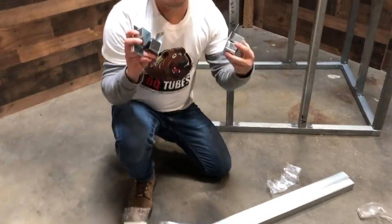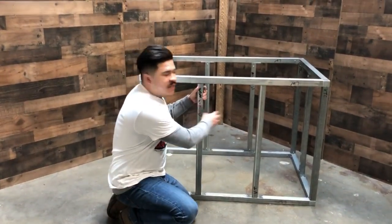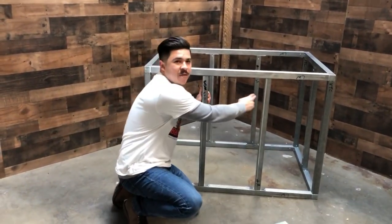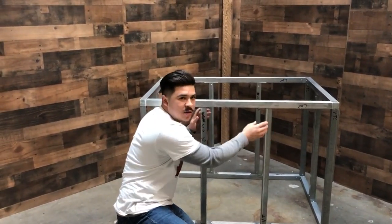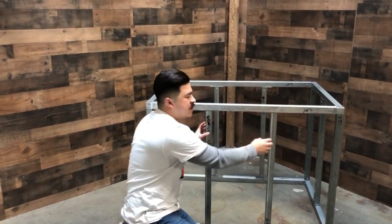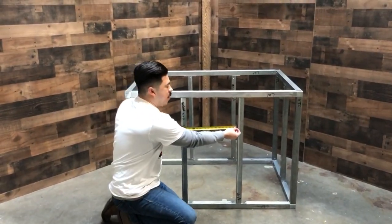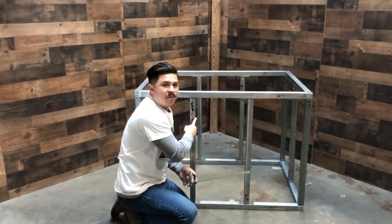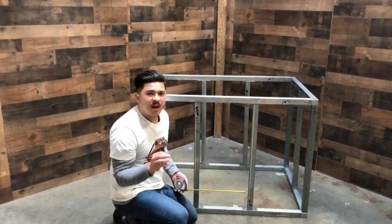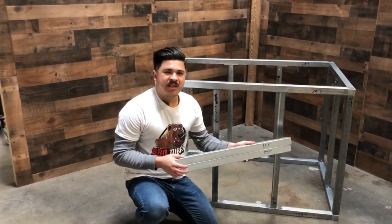You have four of the one-way connect couplers. The first step is to take your VTs and position them for the cutout width of your door. These VTs are included with your module, so you use the ones that come with your module and position them wherever your single door is going to be. Our cutout width is 14 and a quarter inches, so we're going to space these apart 14 and a half inches — we want to leave that quarter inch for some wiggle room.